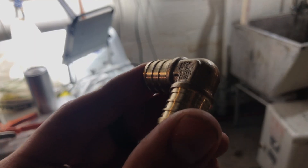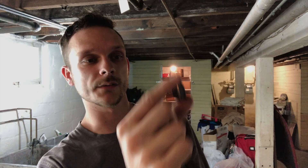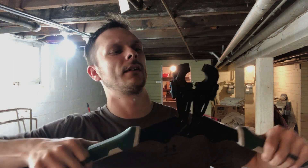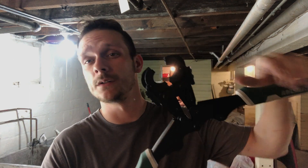It's a ring-shank nail — you just nail it up there. We will be using some of these fittings. Now these are a crimp-style fitting, and then we also have a crimp ring. These are sized for three-quarter inch, because that's the size of our pipe. You have a crimper, and they look somewhat like this. They have different heads for different sizes, so we're using three-quarters. We'll show you how to do all that — it's super simple. You could do this on a Saturday morning by yourself.